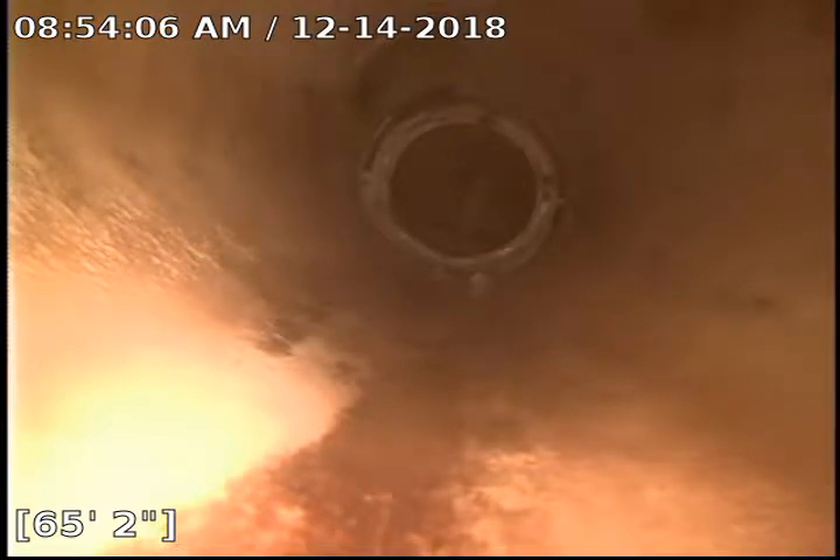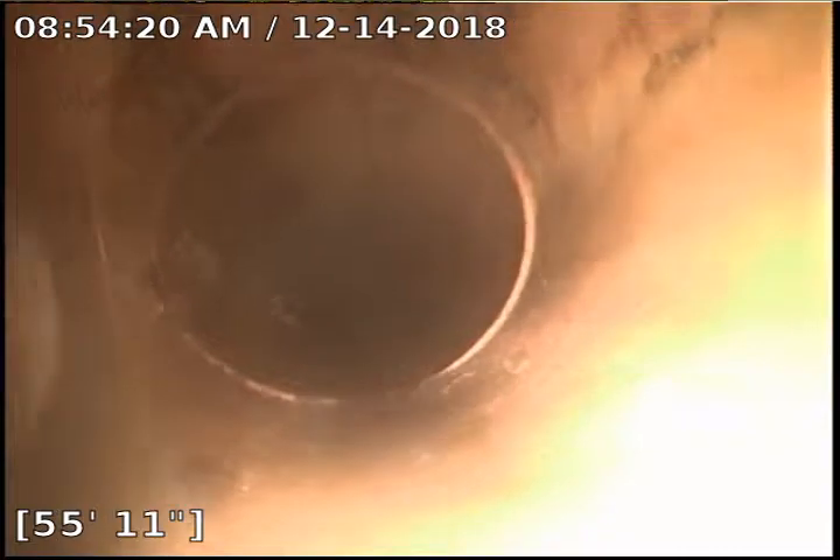All right, so I'm well past the sinks — I'm actually up under those floor drains in the kitchen. We want to pull back and make sure you see where we've been scrubbing this line; it was just totally caked. We went up all the laterals too — the jetter kept turning and going up the laterals. So all these are just floor drains. The most important is going to be the kitchen sinks. That's where the kitchen sinks tie in, where the dishwasher is, and on the other side of the wall — that's probably the one on the other side — and when we come down to this Y, that'll be the other sink.